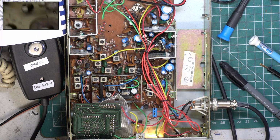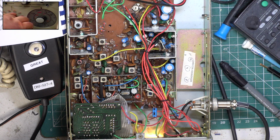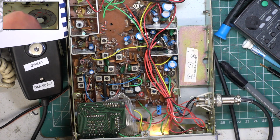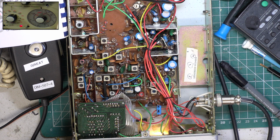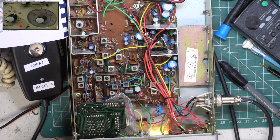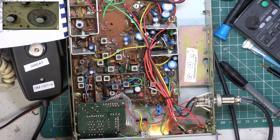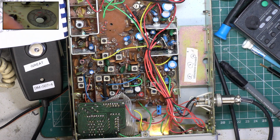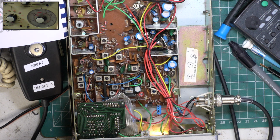100 microvolts is bringing it in. So I put the camera to the attenuator. So we're at 30 microvolts there, 100 microvolts on full squelch. So now we'll turn the squelch down on the radio. And let's turn the signal generator off. Put it to standby to 0.3 of a microvolt. Set the squelch to threshold. Switch the signal generator back on. You can just hear that. So it's coming in at 0.3, it's leaving about 0.25. So it's sensitive enough, but it's not good hysteresis. But there you go.